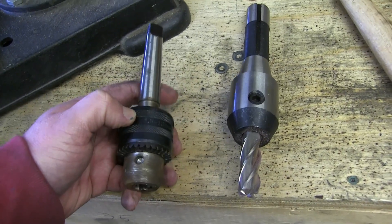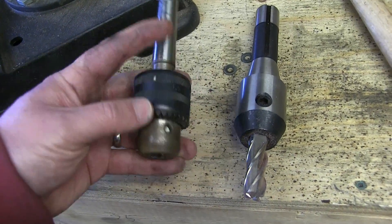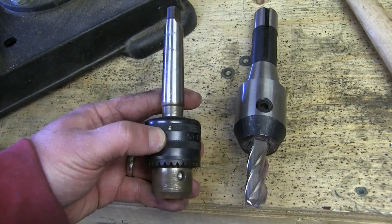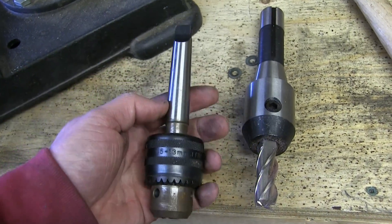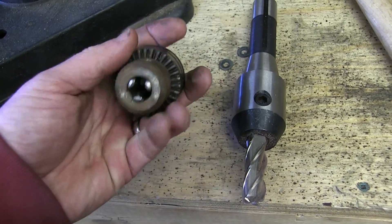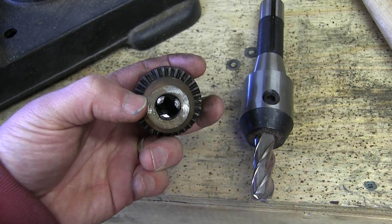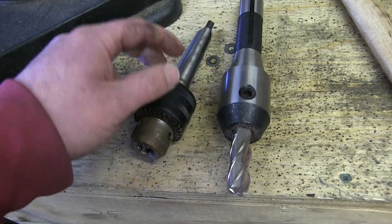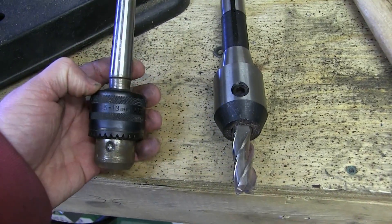To the casual observer, a milling machine is very similar to a drill press — it's got a spinning thing that you put bits into, it's spinning and you press down, makes holes. However, there is a huge difference in the arrangement. This is what came out of this drill press — a Morse taper shank and a Jacob's chuck. It doesn't really hold it dead-center. When you're milling, when you're cutting on the side, you need it pretty much dead nuts on.